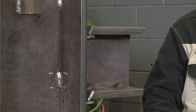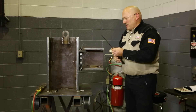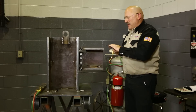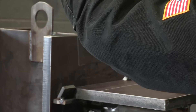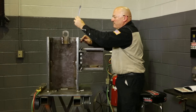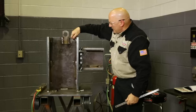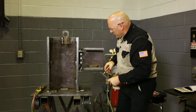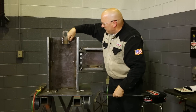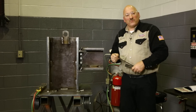I like to mark out the area approximately where we're going to be heating — nothing too precise, we can go a little beyond. I'm going to go about three inches out from the weld and put a soapstone mark, and approximately three inches up from the top of the weld, which almost takes me to the top of the plate. That would be all the way through to the backside and down here on the bottom. I'm also going to mark about three inches back on the backside, and then we're going to check it with a temp stick as we warm this part up.